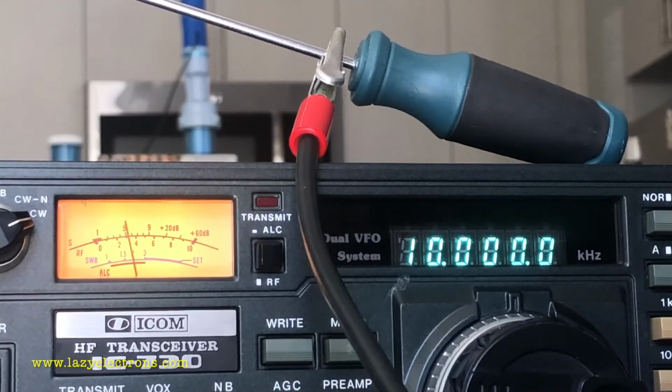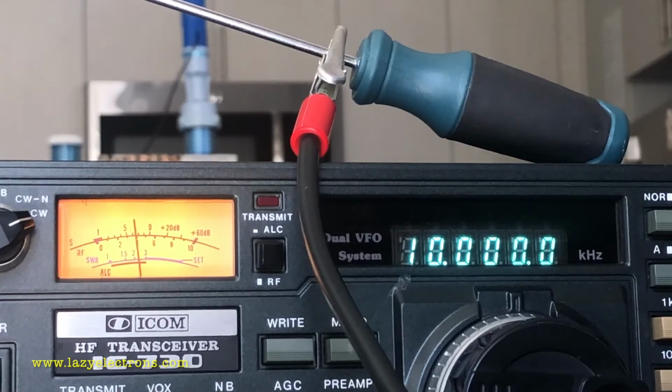Here the process is exactly the same. Instead of using the 10 megahertz amplified output, I'm going to pick the 1 microsecond pulses, which will have 10 megahertz as the 10th harmonic in it, which is tied again back to the 1 megahertz crystal oscillator.